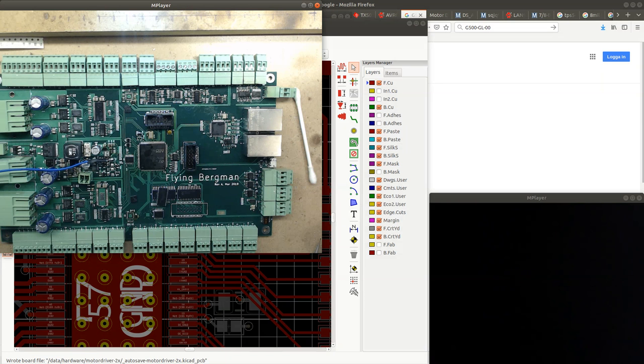and I was trying to feel where it was getting hot, and I couldn't find, like, a single place where the board was getting hot, but the wire itself was getting very hot. So that led me to believe that there was a short somewhere where there is very good heat sinking capability on the board, and two such places are the driver chips,